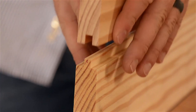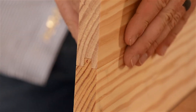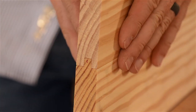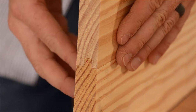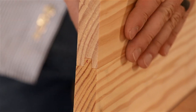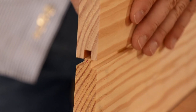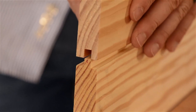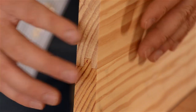A tongue and groove joint is commonly used in applications like wood flooring, the bottoms of blanket and tool chests, and the backs of traditional cupboards. It consists of a tongue board that inserts into a groove, and this allows for seasonal expansion and contraction as the humidity in the air changes. The joint doesn't have to fit tightly as long as it overlaps, and it's preferable that the tongue is shorter than the groove so that the joint isn't pushed apart in higher humidity.